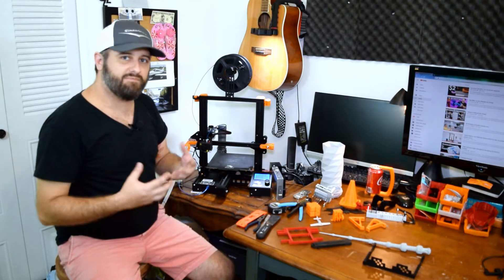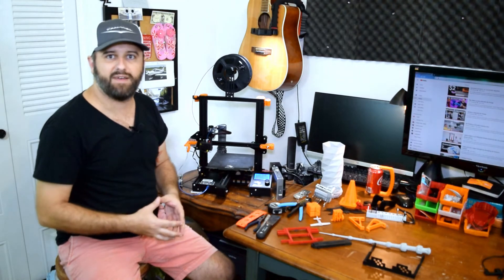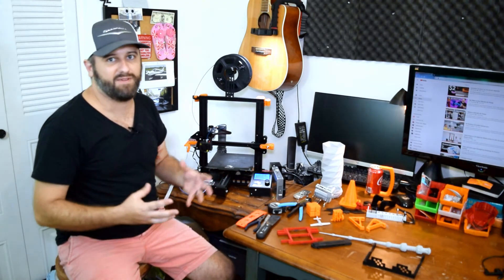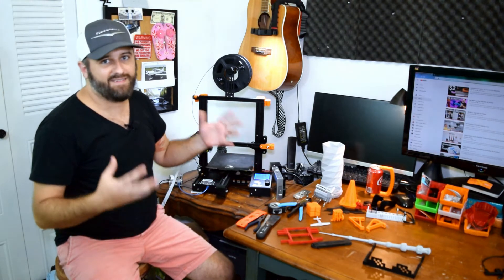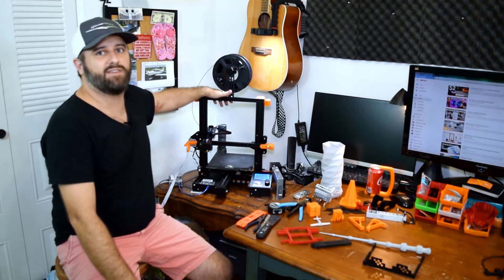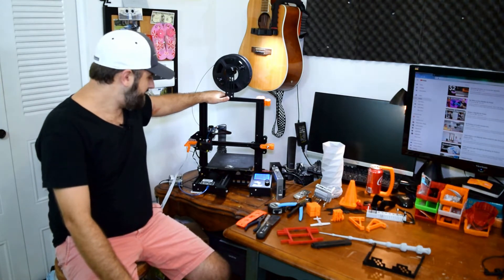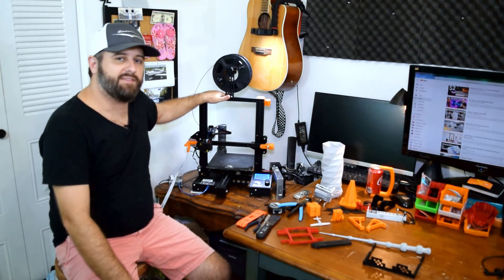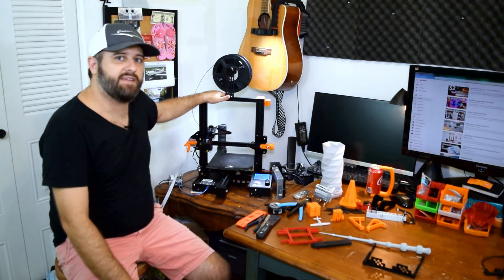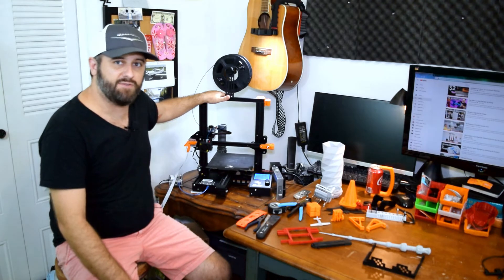There's also ABS type materials. That's the plastic you're really familiar with — it's what most car plastic parts are made out of, injection molded rather than printed. ABS is ubiquitous in the automotive industry, so you can print it, though I haven't tried it yet. I believe it's more difficult, and the recommendation is to have an enclosure for your machine because ABS will frequently warp. There's also ASA, which is similar to ABS. I haven't tried that yet either, but I've seen other people — like Teaching Tech — make car parts out of ASA. That's another one I plan to try in the future.